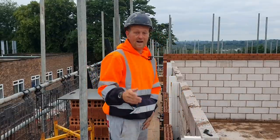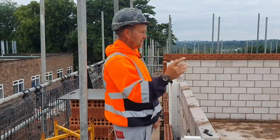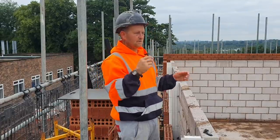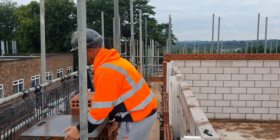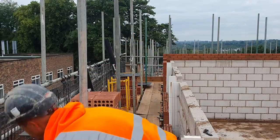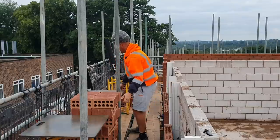Right, first job. It absolutely razzed it down last night, but I didn't cover any of my brickwork up, and I'll show you my brickwork after. It's kind of been touched, it was red hot yesterday. Ready mix mortar, bricks are dry. So I thought, oh, I don't need to cover it up, even though new storms were coming. Let's get this set up. Covered all these bricks up, ready for today. But I didn't cover up the actual walls, even though I know you should.